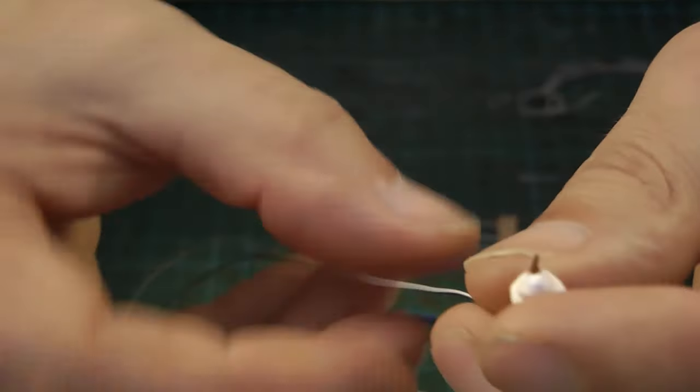Well, I managed to get the drill bit out, so I shall tighten it back up into the drill brace, as it were, and give it another go, because I didn't go in far enough. So I shall tighten it up a little bit harder this time, and then give it another go. So we've done the pilot hole, so I'm just opening up the hole now with a 2mm drill bit. I'm just going to do it ever so gently and at a very slow speed, and hopefully we've gone in there deep enough to put the LED in.